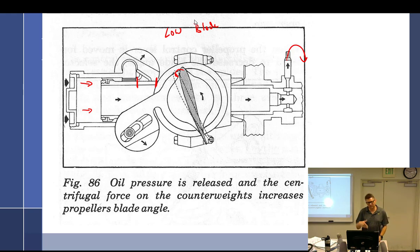And so I was talking to somebody who helped me through it. And I'm like, man, what do you do with these rings? She's like, they're irreplaceable, Kevin. You just take them apart and carefully put them aside. You carefully put them back on as long as they're not broken. They're reusable. These are antique engines. So I did all this and finished it, sent the engine out. They put it up, and I'm always very nervous about that kind of work. It's like, oh, man, I hope it works. So much labor goes into these engines. And I get this call, well, your engine's crap. What happened? We started it up and it slung oil all over the entire airplane.